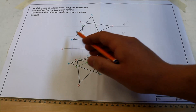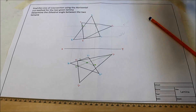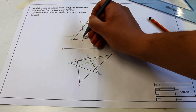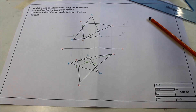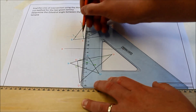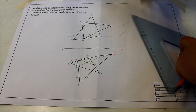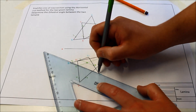C is coming from one of your points: it cuts the ABC triangle again over here and it cuts the DEF triangle down there. Label those points — this is point C, then point three here, then points four and five. Project them down to plan and find them in plan. Now join C back to three, and four back to five.